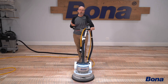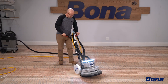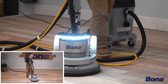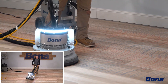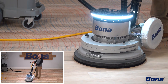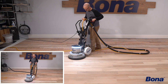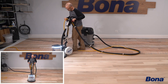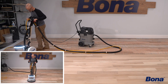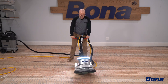Then I straighten it back out to the perpendicular position so I'm feathering as I come back. If you get into a really nasty floor and need to be more aggressive on a first cut, you could go with that more aggressive angle both ways — up and down the floor — with it turned like this moving right to left, then this way coming back, moving that cut point around so it's cutting heavier across the grain. On successive cuts, we'd definitely recommend the perpendicular method to make sure you're cutting and feathering, not just cutting the whole time.